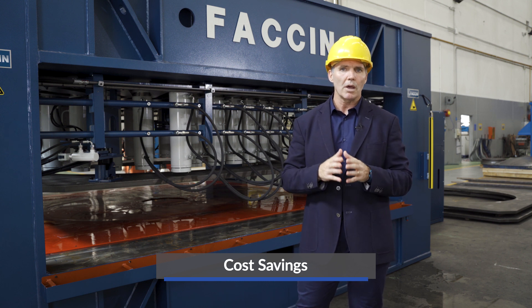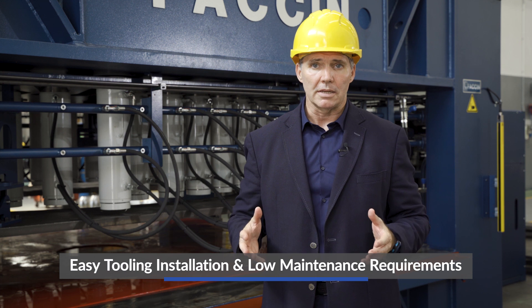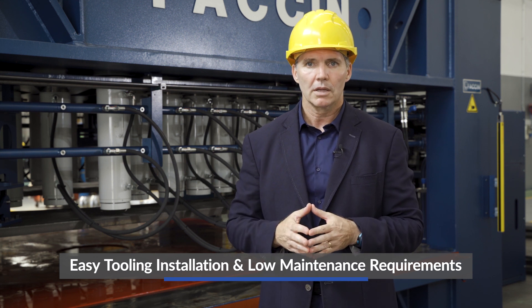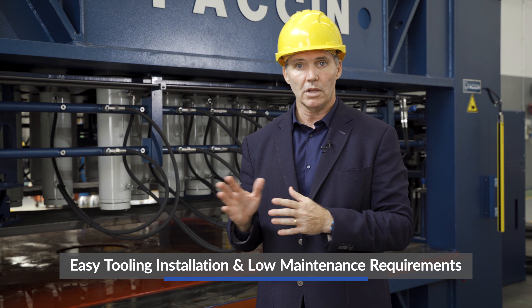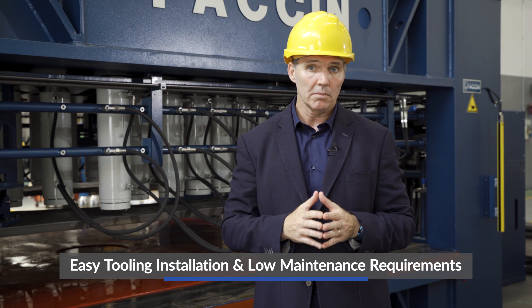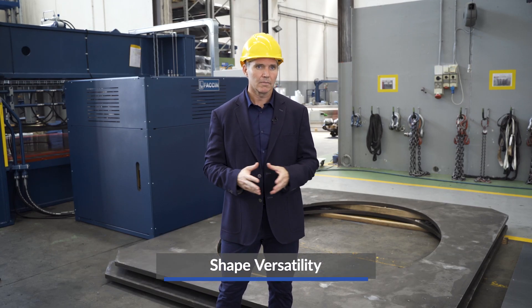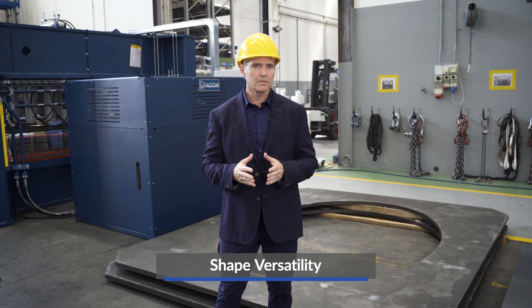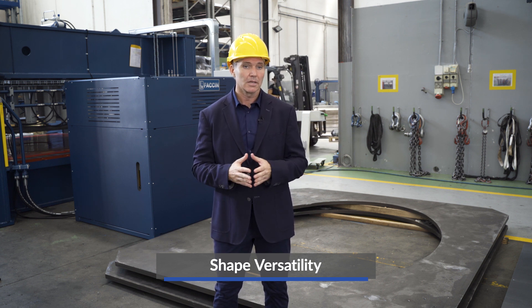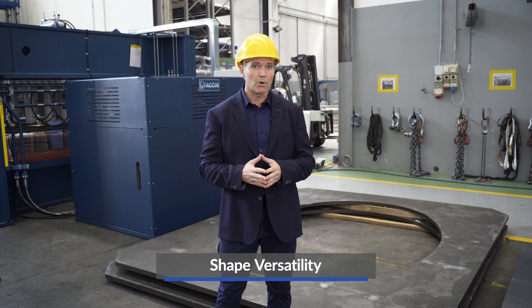Because of these minimum internal requirements, hydroforming tooling gives you a much faster return on investment than the tooling necessary for other solutions. Regarding tool installation and maintenance: the process of installing conventional dishing press tools can be both lengthy and complicated. The PPH2500 tools, on the other hand, are designed to mount quickly without the need for complex manual adjustments. This saves time, costs, and prevents wear and more frequent maintenance. For shape versatility, hydroforming with the PPH gives the manufacturer the ability to form complex shapes with ease, since the process does not require matching dies. The only requirement is to mount a new die, like these ones, create or load the matching program, and press start.